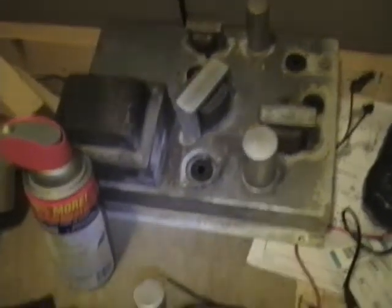Here are the power supplies from both of those sets. I'm going to work on them at the same time — while I'm working on one, I can use the other for reference in case I can't remember how something was wired originally. This is the one for the Bakelite Admiral. I'm going to do this one first. If you recall from my earlier video, this was a rusted mess. Since then, I've stripped this down quite a bit — removing the power transformer, chokes, and all that. The chassis is quite simple to work on. I've already recapped this, and I found some pretty nasty capacitors down there too, so it was a good thing I did.